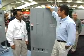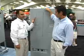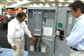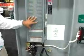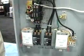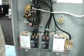It's a load center. Give us some highlights — what do we got going here? It's a power transfer switch used to connect emergency and on-site power, and it's a package that has many components. It's got a transfer switch, an automatic transfer switch, a load distribution that allows you to hook up to many loads, a normal and an emergency breaker, as well as surge suppression. All these components are prepackaged and factory tested so that it saves installation time for the contractors on job sites.